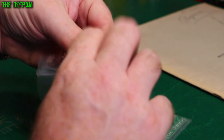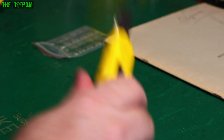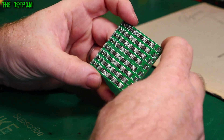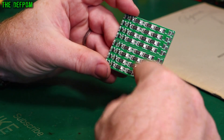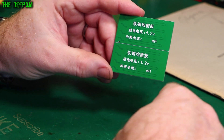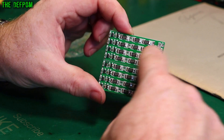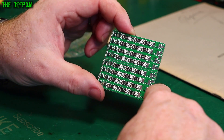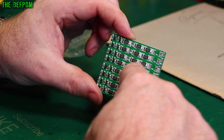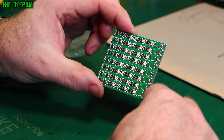I realized what it was - one cell was basically flat and the other cells were fully charged. So I realized I need to sort this BMS thing out and actually get some proper balancing systems. These ones here are a four cell version - it says 4.2 volts on the back, that's for lithium, and we've got each battery connection on the side. This will put a load across each battery - whichever battery's highest, it'll put a load on - and balance them by making sure they're all reading about the same.